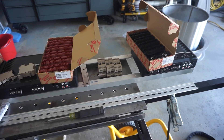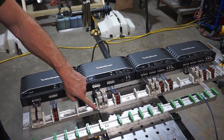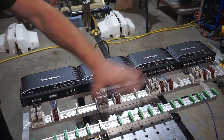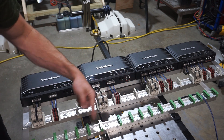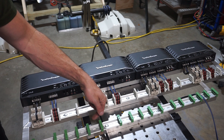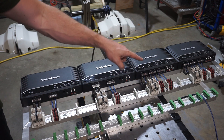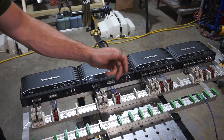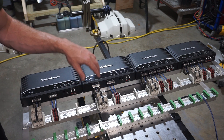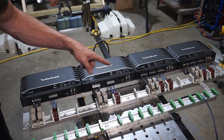It's supposed to be easy — we're not getting any younger. So we got everything all nice and situated. Cables are going to run this way and the plug is going to be on that side. These are bolted in place with hard stops, cables run out this way. Everything's going to get loomed together on top — you drill two holes, wrap the wire with a zip tie, wrap underneath that bundle through this, and it keeps everything intact. We're going to use 12-pin Deutsch connectors for remote and speakers, and all of this will come out on the other end with a tail about four feet long going to a main plug. The speaker wires will have their own plug — none of this will get tied up tight because we still have to put the RCAs on each amp.